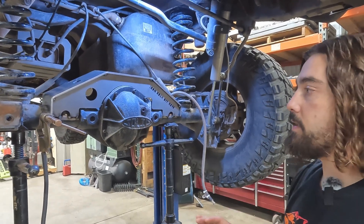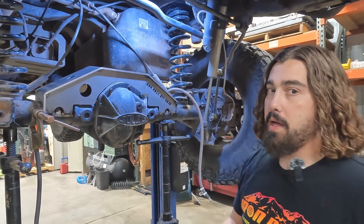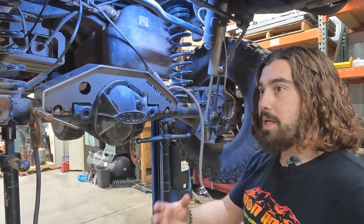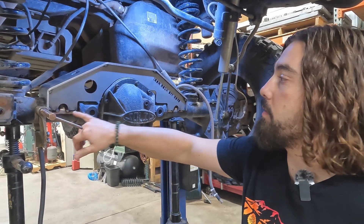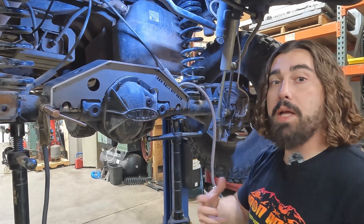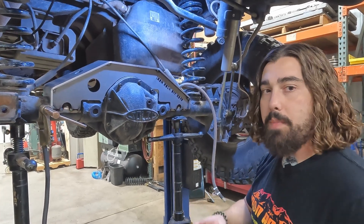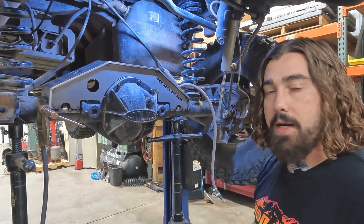As Ryan goes and does all of our full passes around the truss and the axle tubes, we're not going to bother doing the center section on this project. The big thing to keep in mind is heat. Even though this is thick gauge steel, we're pouring a lot of heat in there to attach it — we don't want to weaken the housing when we're trying to reinforce it. So he's going to be skipping around to different places to let it cool down a little bit before putting more heat back in that same area.